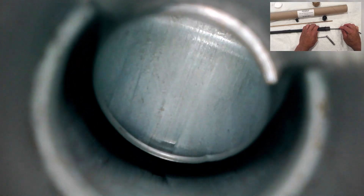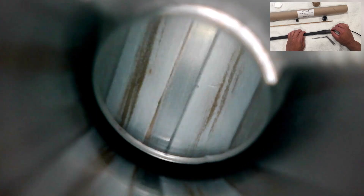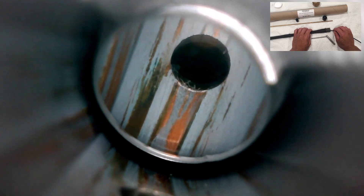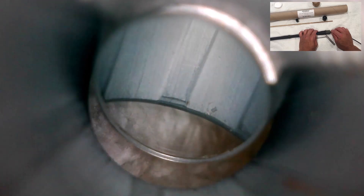Here's a look at the throat, which looks nice and consistent. As we move up the bore, we can get a better look at the rifling. The bright chrome finish makes it pretty easy to see, which is kind of nice, and the rifling looks well-formed. Here's a look at the gas port, which looks like it might have the slightest bit of a burr on there, which is no big deal and it'll probably get shot off in the first round or two. And here's a look at the crown, which looks pretty good to me.